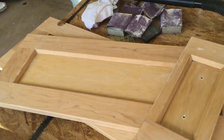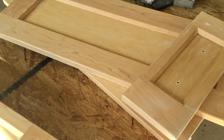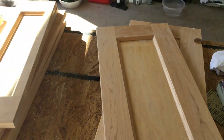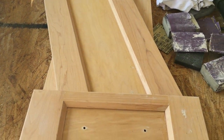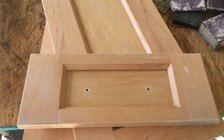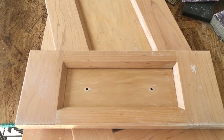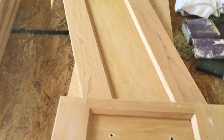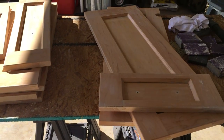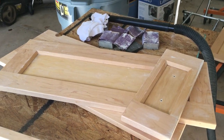Then I'll shoot two coats of a finish. I'm gonna use Emerald from Sherwin-Williams — it's a urethane — and it's pretty much the top-notch paint product that Sherwin-Williams carries for doing cabinets. That's what I recommend. I'll post a video to get my spray booth set up and start spraying. Sunny Florida, alright!